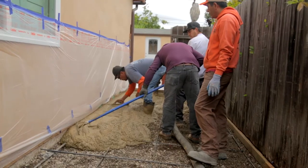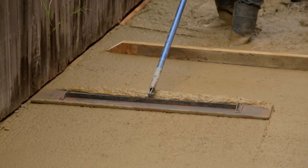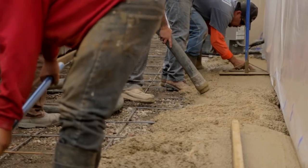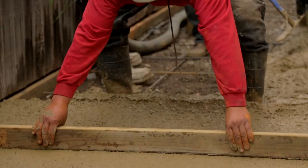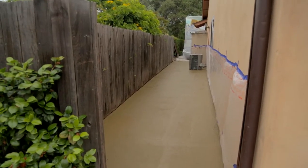Here's where they're screening it off, and while they're doing this, everything with the concrete is about timing. If the mud goes off too fast, you can't imprint it, which means you'll be tearing it out and redoing it. You want to make sure that your forms are set where your water is going to get off of it. Now they've laid it all down, they're going to be cleaning their tools, waiting for the perfect timing.